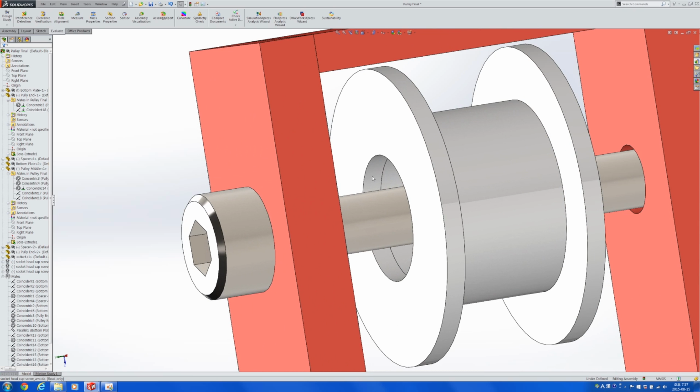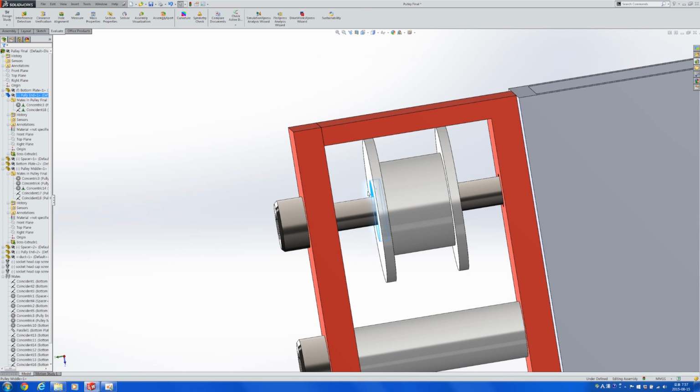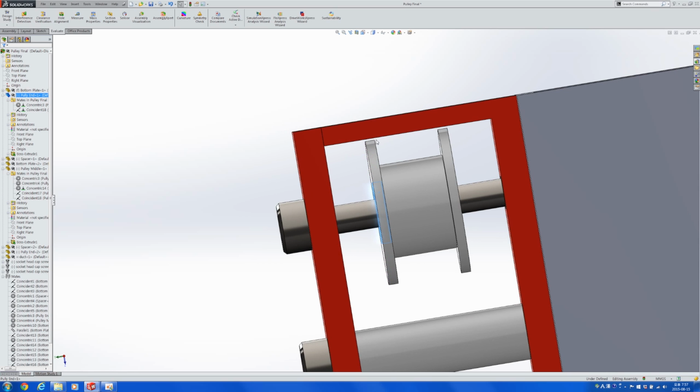It should be around the same size as this hole, which we can obviously change, but then this hole has to be at least a little bit farther away from the edges, so we are working in a very constricted amount of space right now. When it comes to bearings, I would say that there are 2 really good places to get them. One is MISUMI and the other is McMaster.